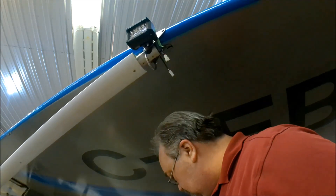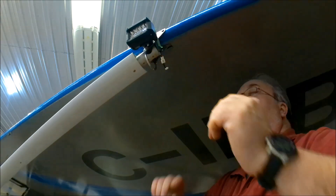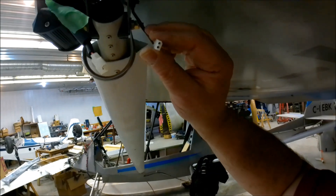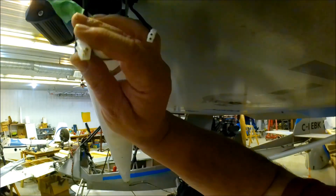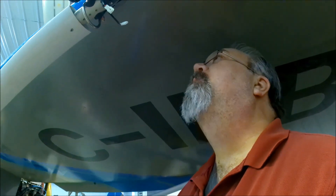There we go. One plug and the other. The negative I put on the flat side, and this side here has a little peak, so it's positive. Flat side is negative, positive on the peak — so polarity matters. Definitely does. I'm going to put the heat shrink tubing on this in a few minutes, and then we'll see what happens.